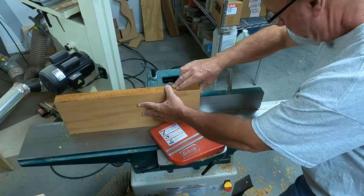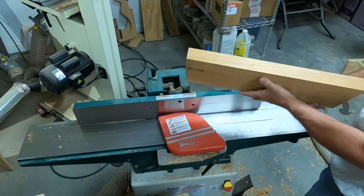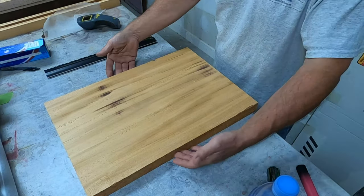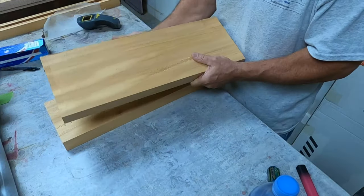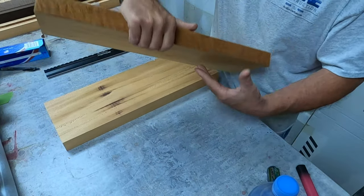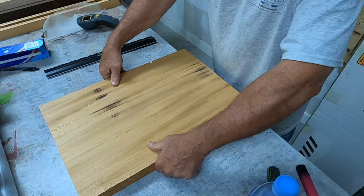Here I'm rejoining it — I ran it through a couple of times with individual pieces and marked it so I could see what I'm joining off, but it still wasn't coming out just right. So I flipped the pieces, reversed the orientation, and ran them again, and it came out really nice. Now I've got a really good fit. I'm going to show here how I've flipped and reoriented the pieces — basically it makes a mirror image. Each piece makes a mirror image of itself onto the other board when you clamp and join it like that. It worked really well.